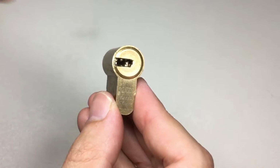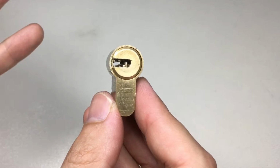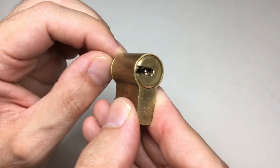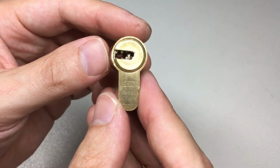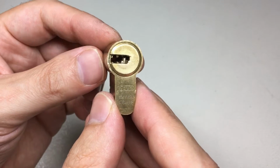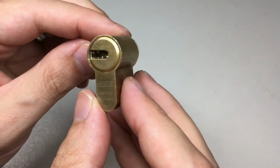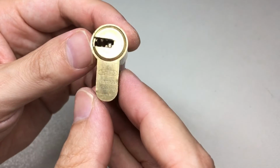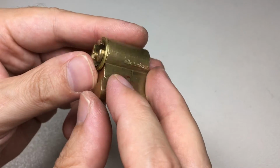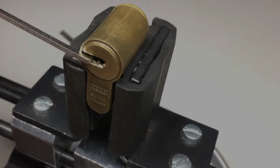If you've seen my Twitter, you'll notice this lock in here. And I think I've tweeted something along the lines of, finally, because I got an open on it. Had a few opens since, but it is tricky. It's just a tricky lock. It seems to get into a false set and then stick. I won't be surprised if there are some T-pins or tapered pins or bevel pins, whatever, to catch us out. The only thing we can do really is throw this into a vise, pick it, gut it, and see what's in there together. Okay, I'll see you in a second.